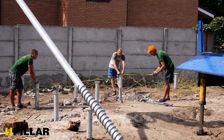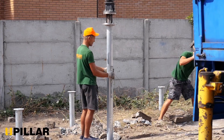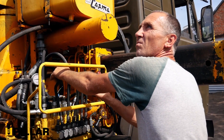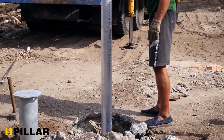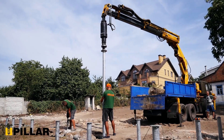The second peculiarity at this site was the level difference. Using ground screws, you can avoid the work for land leveling, just aligning the pile heads to the desired height. We have another specific video for more information about the foundation's construction in case of level difference.